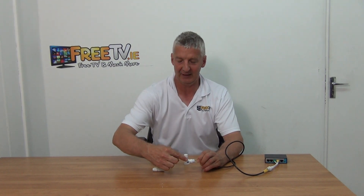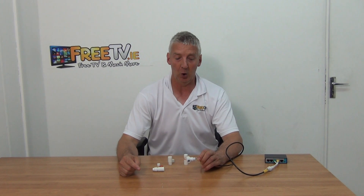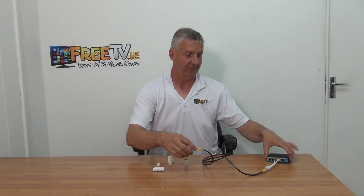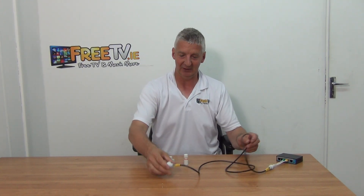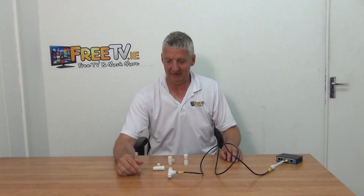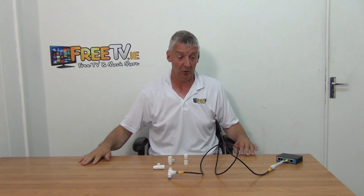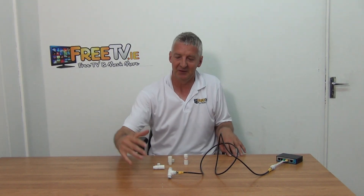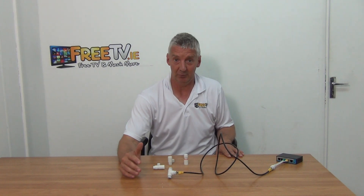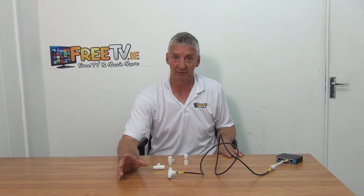So it can split left and right — if you had a camera over here you'd run a cat5 or cat6 cable over here, and another cable over there, so both cameras are being powered off this switch. On the way out we only had a single cable, and you can obviously see big advantages here if you have two cameras that are relatively close together with a long run back to the PoE switch — much easier to do it this way. This is somewhat of a niche product, but it's a brilliant product and it sits really well with the overall range of CCTV adapters and cables that we sell here on fruitTV.